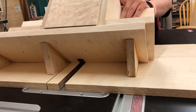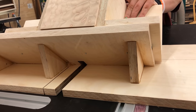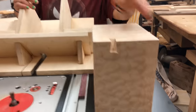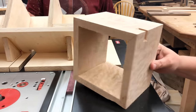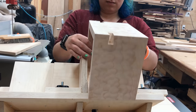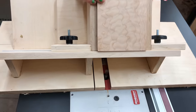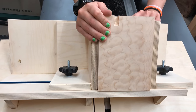I'm trying to use my air gun to blow the dust out of the way so you can see the cut. Now you can see it — there it is, the dovetail cut. Some fibers tear out there but even though there's no backer it doesn't tend to tear out the board itself, which is nice. Once again it's the exact same procedure: make a cut, rotate the box 90 degrees and make the next cut, proceed until all of them are done, then flip it end for end and cut the other side.